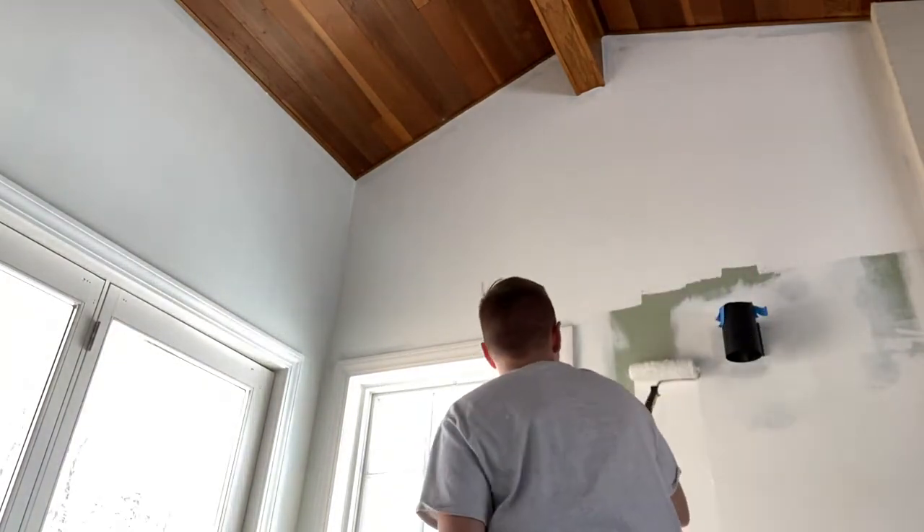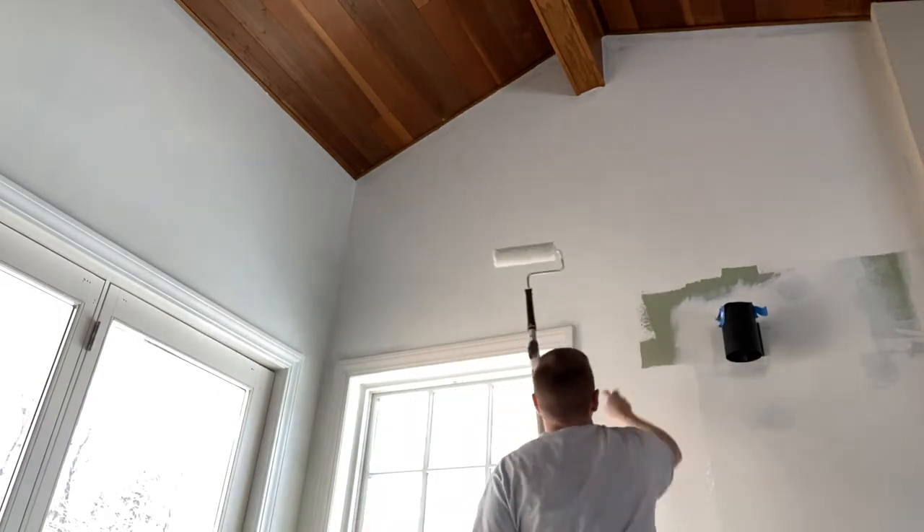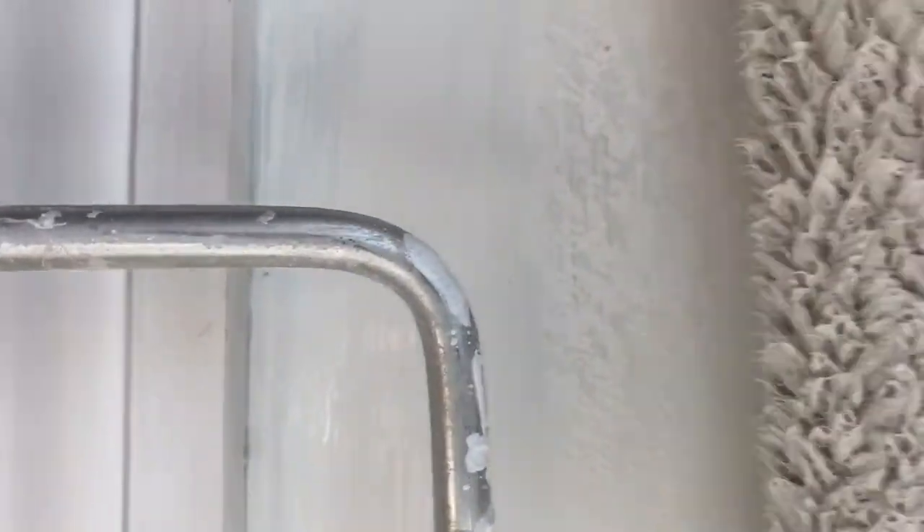This is the very basics of rolling — it just takes a lot of time and learning. As you saw there, I just picked out junk in the paint. This paint was actually pretty old and should have been strained. You can see up close the difference of brushing and rolling and all the stuff in the paint that should have been strained — but we will cover that in a different video. This is just the plain, simple basics of rolling and a quick couple of tips to help you get a good professional job. Make sure you like the video, subscribe to my channel, and we will have more painting videos coming out soon. Thanks.